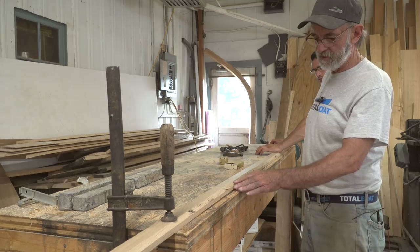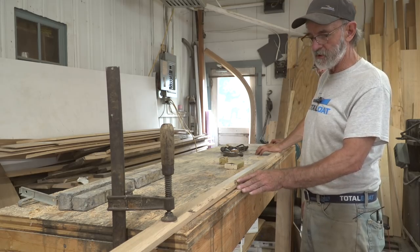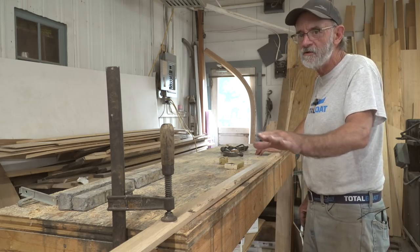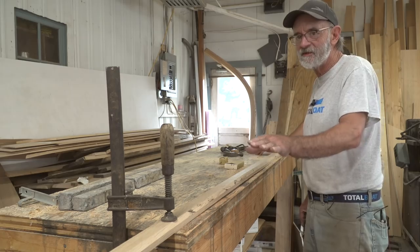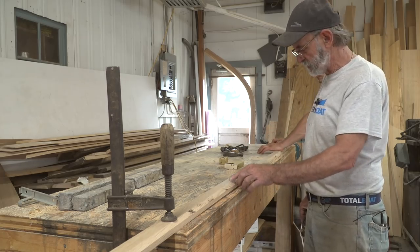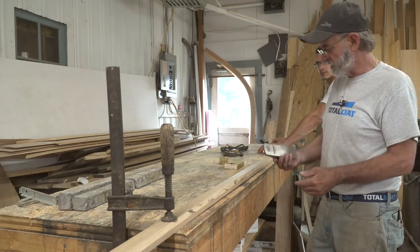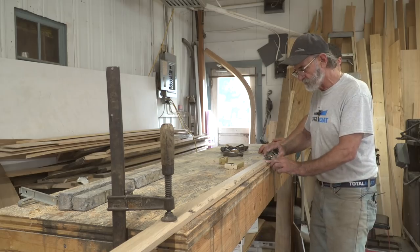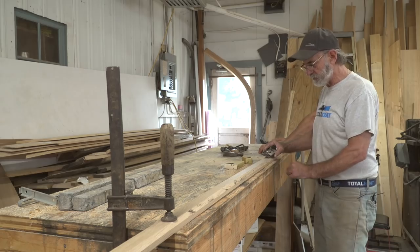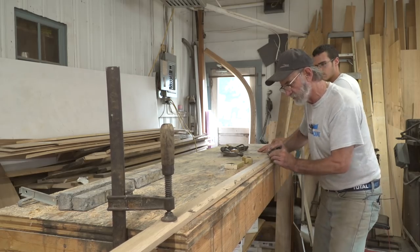Now that I've ripped that corner off in the table saw to 45 degrees, it worked out pretty nicely. You do get a couple of burn marks because the piece was curved and it's not the easiest thing to push through perfectly — the sides of the blade burn it. So I'm going to take a little block plane and scrub off those marks, because it would take quite a bit of sanding. The plane works really fantastic on something like this.